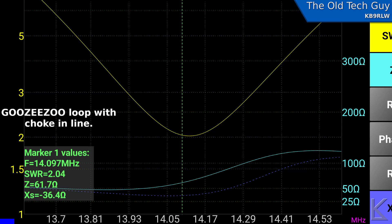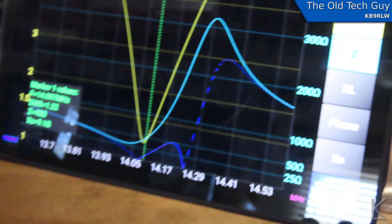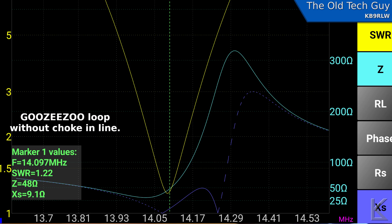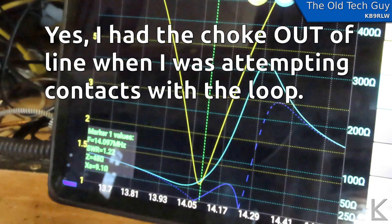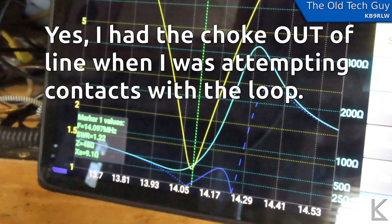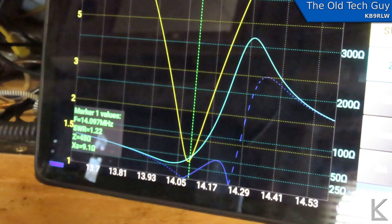I was getting ready to do some WSPR testing using my Blue Mini VNA to tune it to the WSPR frequency. The lowest SWR we can get is 2 to 1, and the bandwidth is quite wide — so it's not going to be a very efficient loop. I took their common mode choke out just to see the difference, and what a difference: the SWR came down to 1.2 and the bandwidth narrowed right up. Much much better without their common mode choke in line. I think I'll use the loop without it — might get a little RF back on the coax shield, but at QRP power levels that's probably not a big deal given how much better the characteristics are.